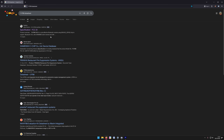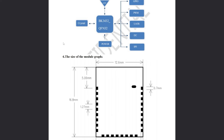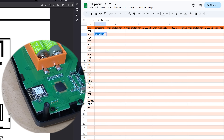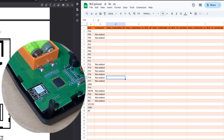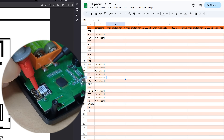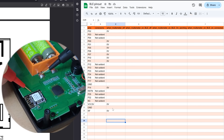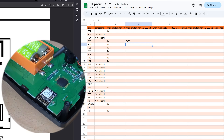So I needed to figure out how the multimeter talks to the Bluetooth module. I found the datasheet for the Bluetooth module which included a pinout — some pins like RX and TX were self-explanatory, but the others I had no idea about. So I made a spreadsheet with all of the GPIOs listed and the different states the multimeter can be in: off, on, Bluetooth on, Bluetooth connecting, and Bluetooth connected. From there I started measuring the voltages on each GPIO pin during the different states.